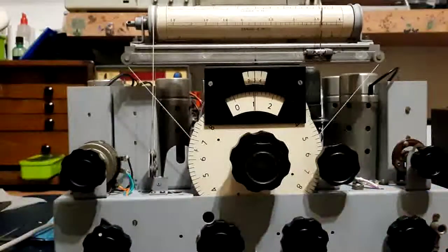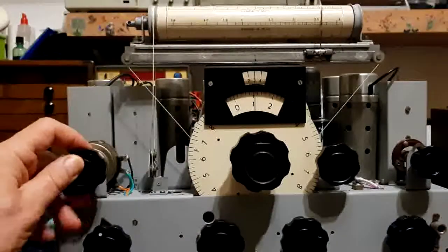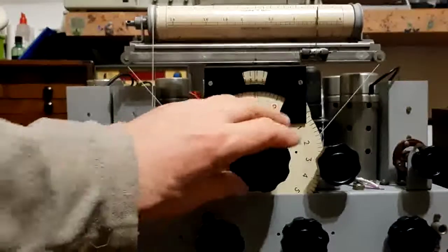As I say, I've seen some of these with product detectors in, and like an additional add-on so they can resolve the single sideband better, but I don't think I'll go that far. Another thing is that 3.5 to 3.8, the amateur band, is very squashed in the little space there. Didn't find any Morse. It's good for Morse.